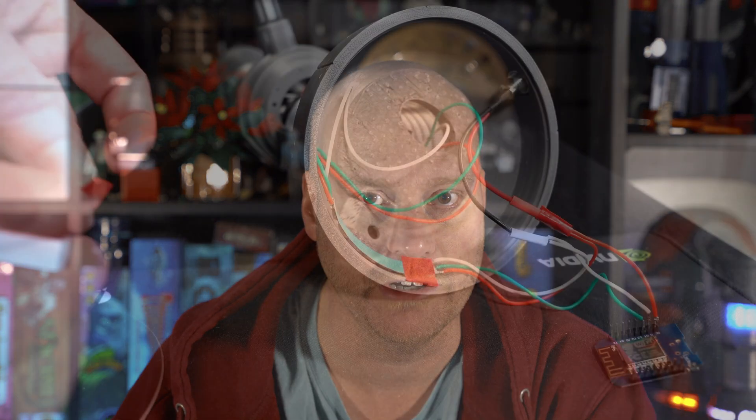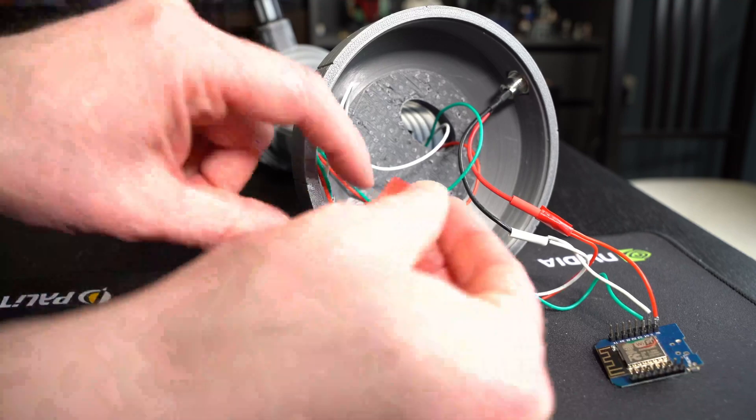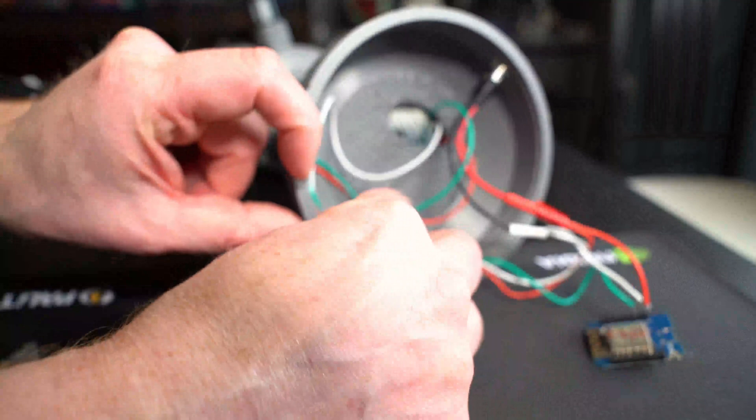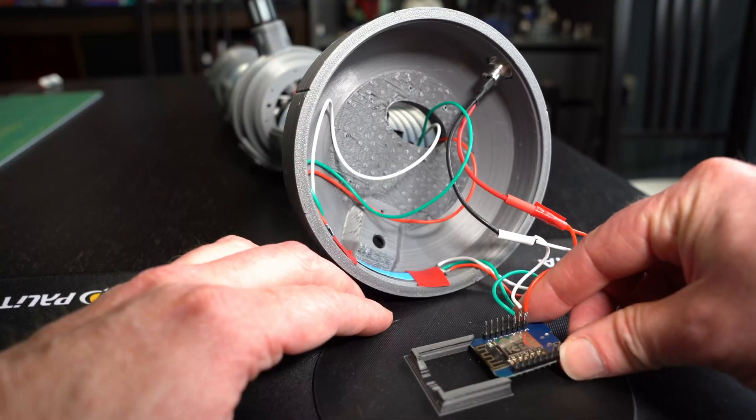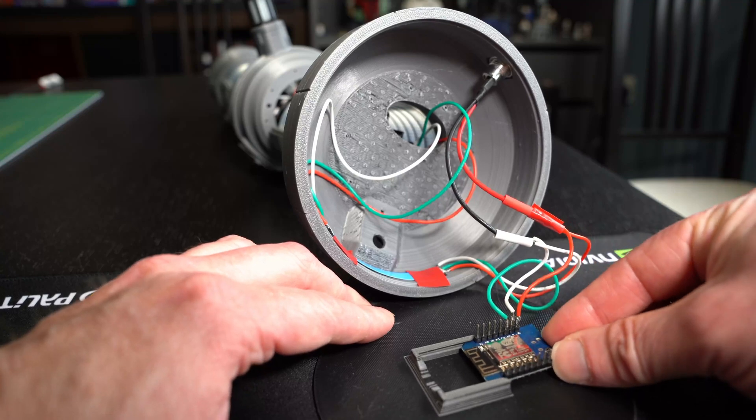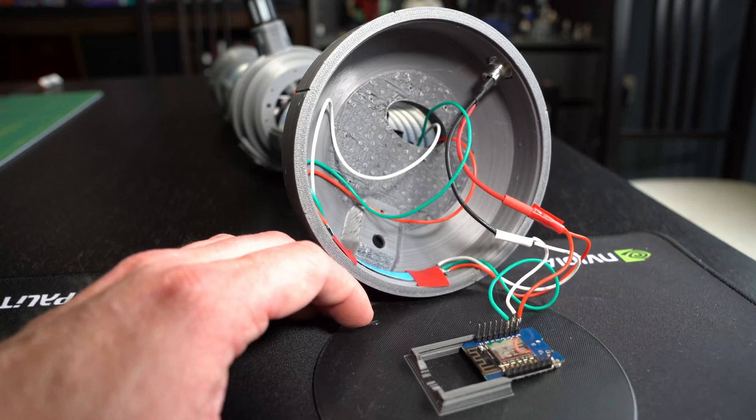All that goes from the board to the LEDs is the data signal telling them what to do. You can then stick down the 7 LEDs that light up the registry on the base — I've just used electrical tape here. For the final bit of the electronics you just need to slide the board into the bottom of the base. If you've done what I've done here you'll see that it doesn't actually slide in all the way, but it seems secure enough so I'm leaving it at that. That's it for the electronics.